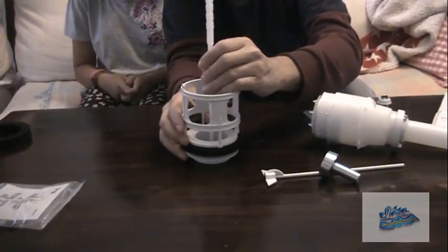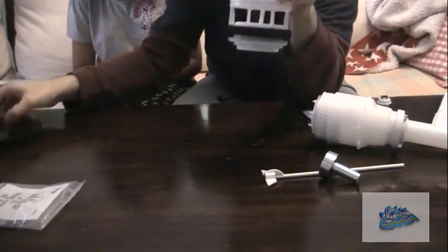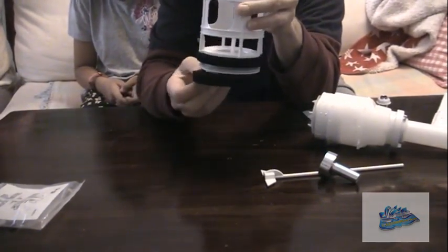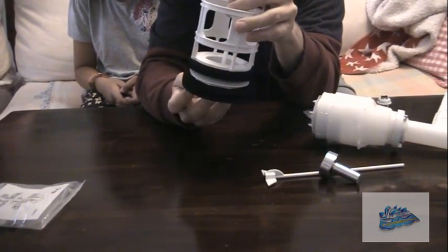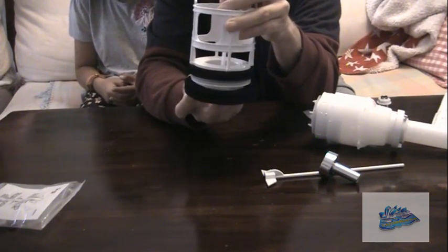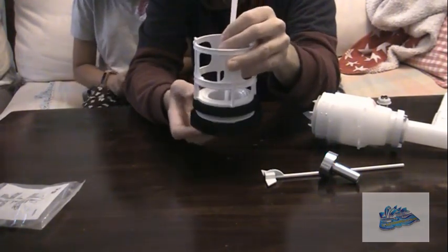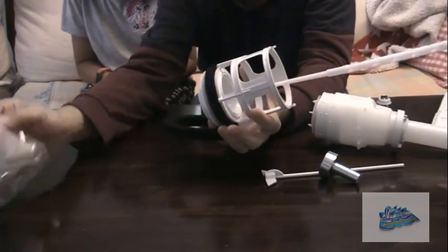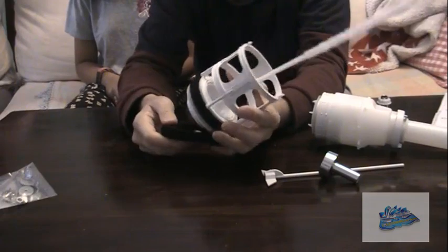Now we can put the cistern back in place. We'd use a rubber. Our rubber now goes underneath this, under the cistern. If you want to use a few blobs of grease or something sticky to hold that in place, maybe a bit of silicone underneath the cistern, so that when you lift the cistern back onto the pan, that will stay in place. And then put your bolts through. You can use the new bolts which come in the kit. Then you can screw on with a wing nut underneath.